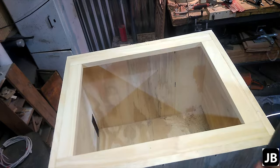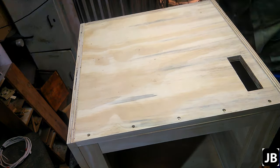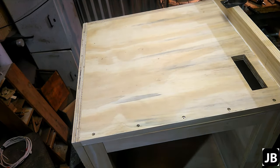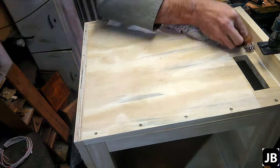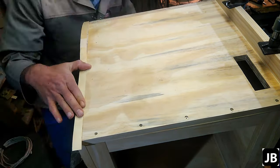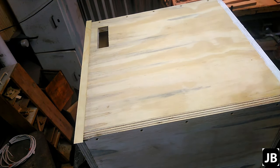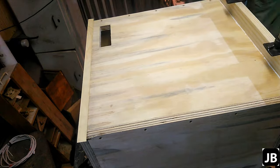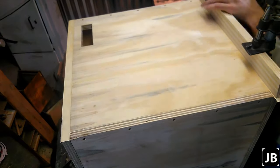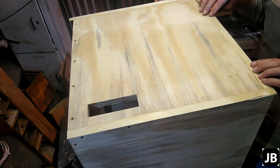As you can see, I've just taken the file and took the edges off. The edge stripping is actually wider than the 18 millimeter plywood, so I let it stick over on the end and when it was all dry I just took off the edges. The cold glue just wipes off with a wet rag — make sure your rag is clean otherwise you smear it onto the wood and have to sand the whole thing off afterwards.